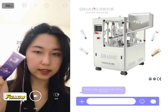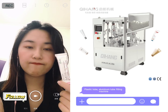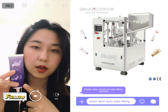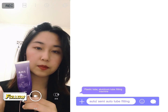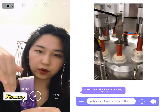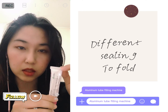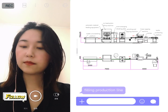For example, here is the tube — this is the aluminum tube and this is the plastic tube. Here is the laminate tube and this is the laminate tube as well. What I want to introduce is the filling machine. If you choose tube packaging, you use a tube filling machine. You put the tube into the tube filling machine, the top is open, and you put the material in and then seal it. For aluminum tubes, you need a different model because the end needs to be folded.